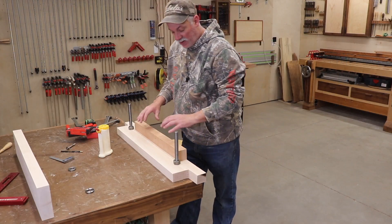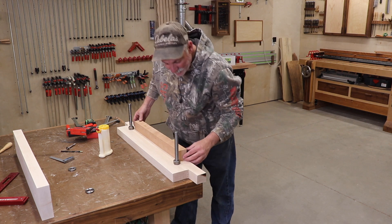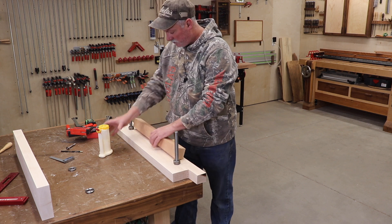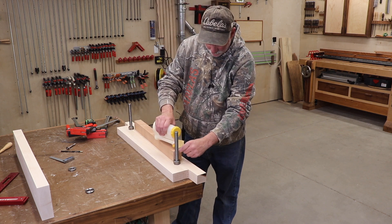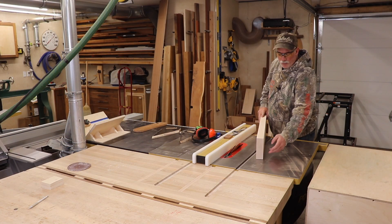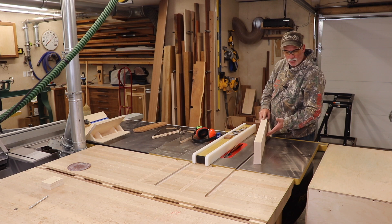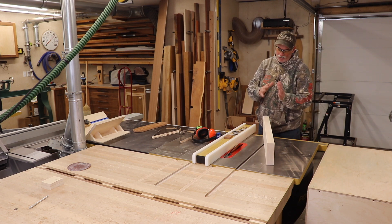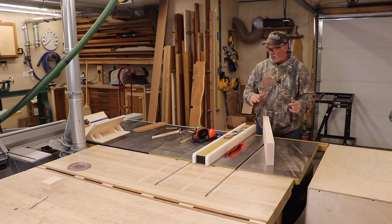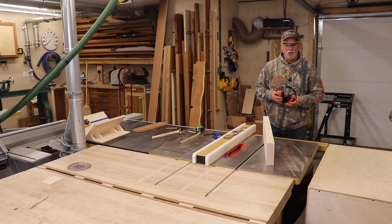The last thing I need to do here is get this back support glued on. I just set bolts in place temporarily to help me eyeball center, since this is all just for clamping down. While we're waiting for that glue to cure up, I want to go ahead and chamfer this outside edge — so if I want to do some half-blind dovetails or something like that, I have just a little bit of extra wiggle room. I got the blade tipped close to 60 degrees. The number doesn't matter as long as you get the piece off that you want. I'll chamfer this now, clean it up, and we should be getting pretty close to putting this thing together.